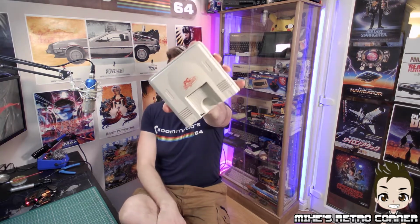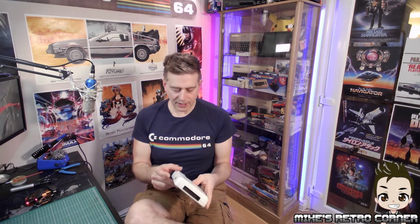Now, if you saw the first video we did in this series, we were looking at this PC Engine and the fact that when we opened it all up, the internal fuse had been replaced. Well, not replaced, but it was still in there. But there was a piece of wire just soldered across the bottom contacts. We're going to fix that today. I like to see things as they should be. There's also a kind of ground plane that was also just taken off. It wasn't even unsoldered. So we want to put that back on as it should be.